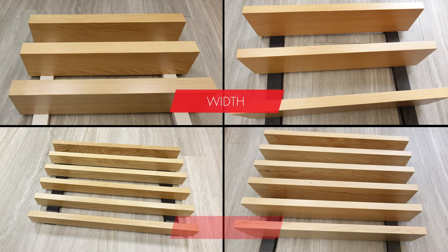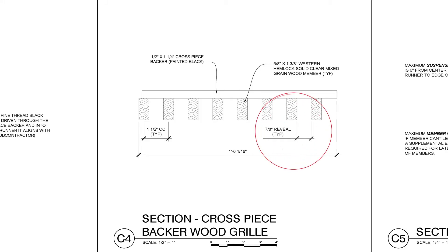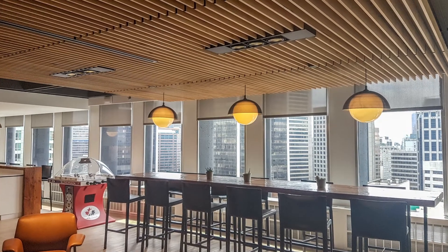You can adjust the member width, the member depth, and you can adjust the on-center spacing and reveal. A reveal is the space between the slats, and it is what allows the sound to carry through and to kind of break up the visual impact of the grills.